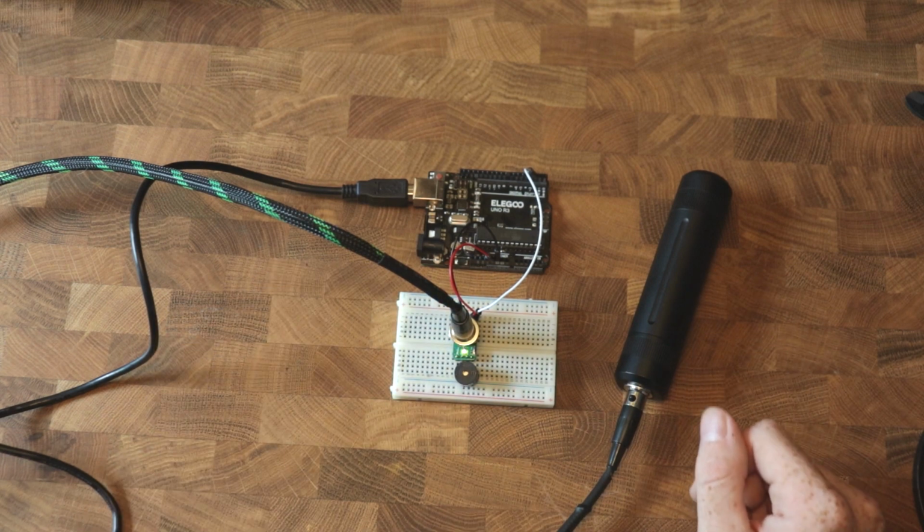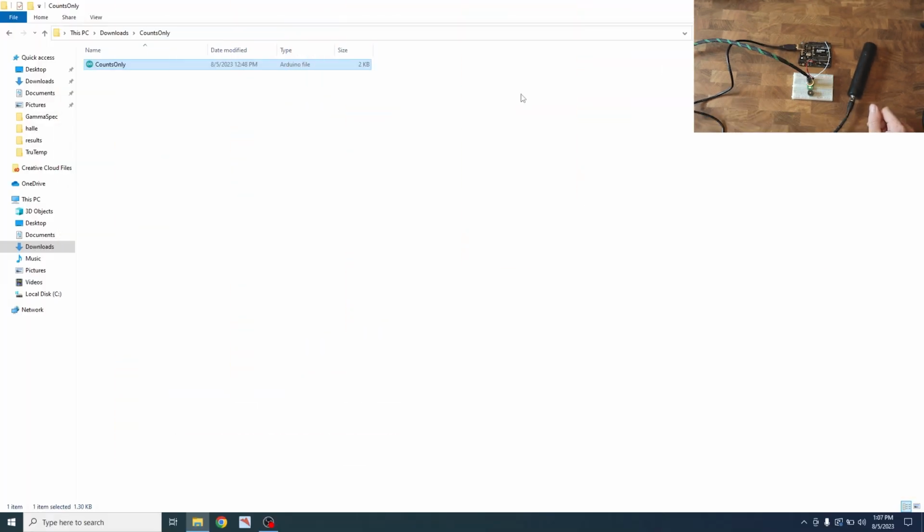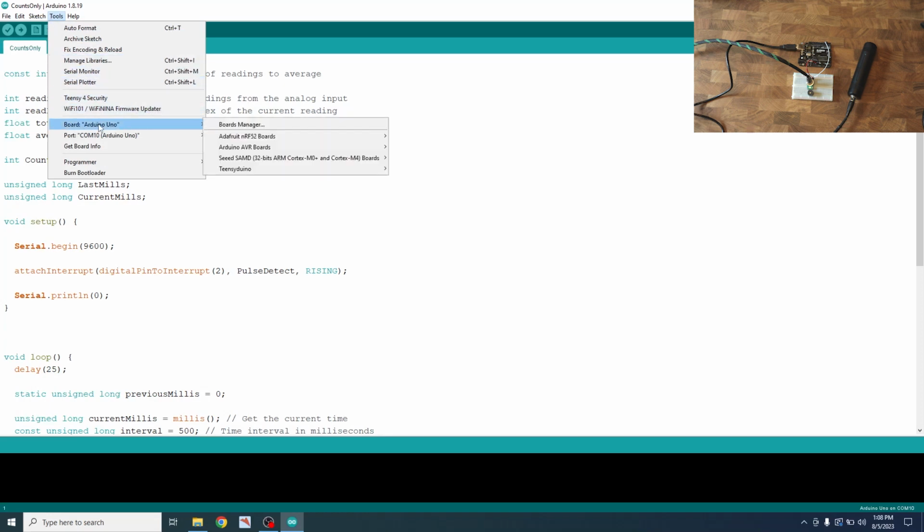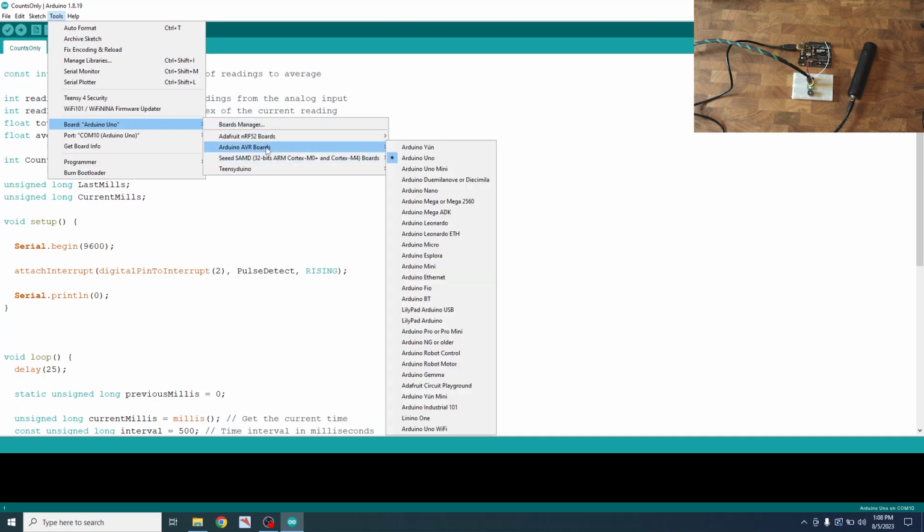Next, we're going to head over to the computer and open up our code. This will be available on the website or at the link in the description of the YouTube video. And if we double click that, right when it opens up, we're going to want to head over to Tools, and make sure the board is correct. The board is the type of microcontroller you're using. We're using an Arduino Uno. So we're going to head over to Arduino AVR boards or Arduino boards, and then go to Arduino Uno. Make sure you have the correct board selected. So here we do.